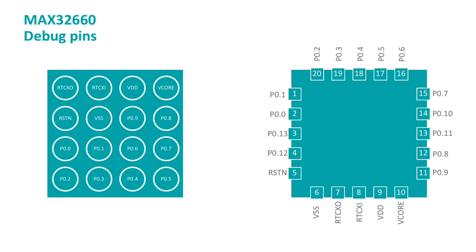Now, by default, the serial wire debug port is enabled on GPIO bits 0 and 1. Those bits are assigned to bumps C1 and C2 on the WLP package, and to pins 1 and 2 on the TQFN. On the WLP, this position precludes the use of the second UART and the second SPI port. If you need either of these ports, you can move the debug port to IO port bits 8 and 9.